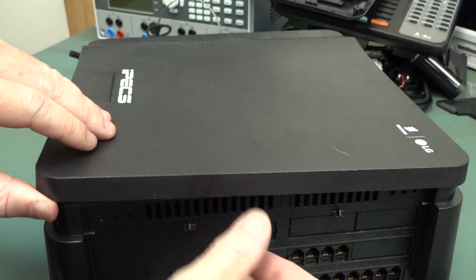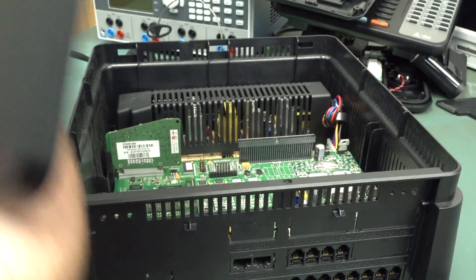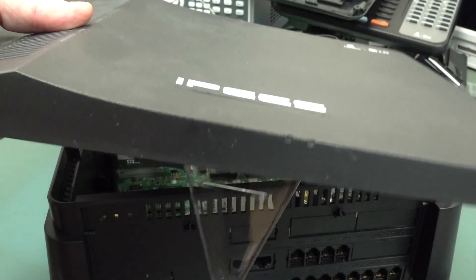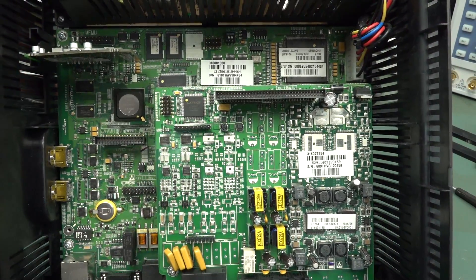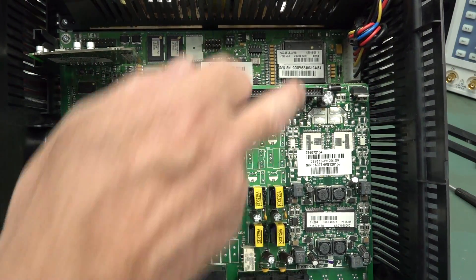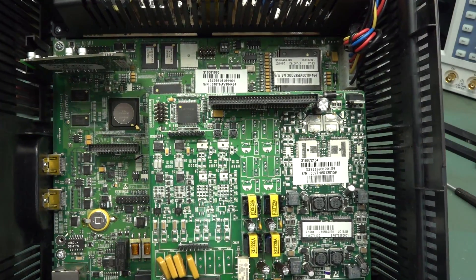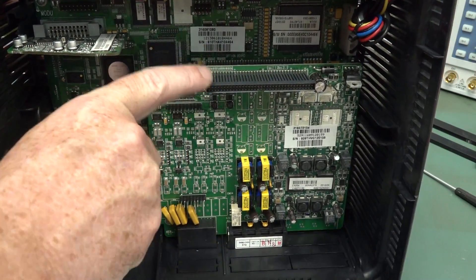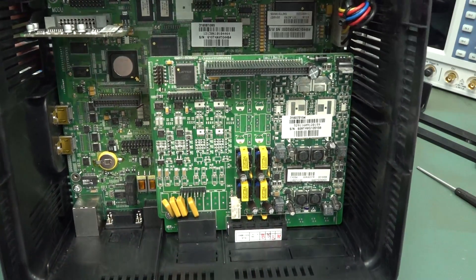It just flips up — two screws on the back. Bob's your uncle, we're in. Got a light pipe that goes down through to just light up the bar — wank wank — under there that no one's going to see because it's installed in the comms rack or whatever. That's just ridiculous. But isn't that neat and tidy? There's a lot of engineering that goes into one of these. I can see a lattice part. And a custom ASIC jobby down here. Another huge flat pack over there — that's enormous. Your line interface board, expansion and a second board could go here. That's why they've got that extender up there — and daisy chain. So it'll come with a base number of channels, and then you add an extra four channels or whatever for each one.